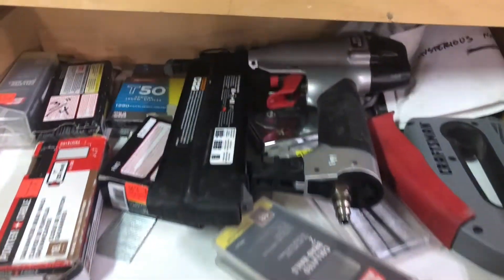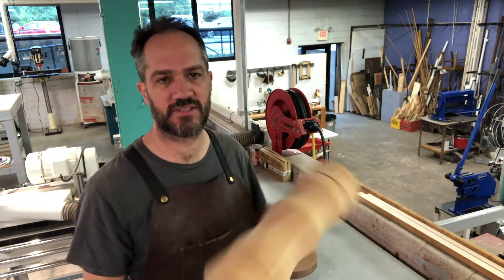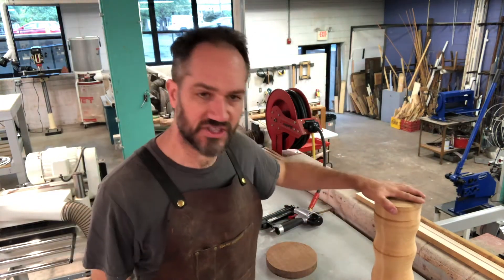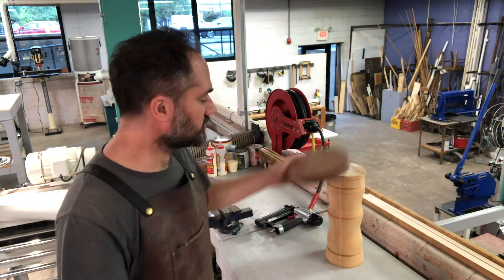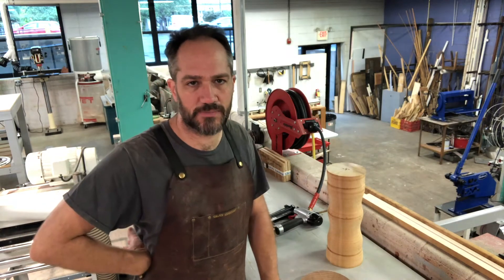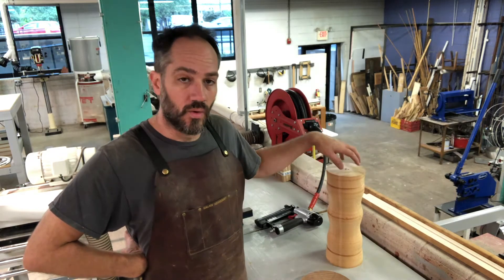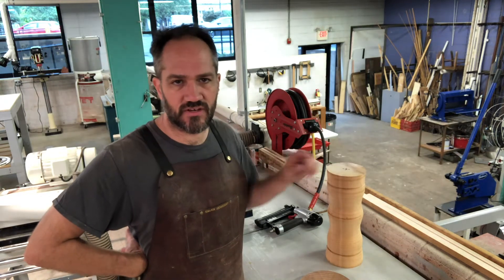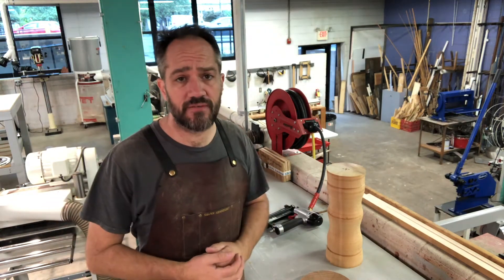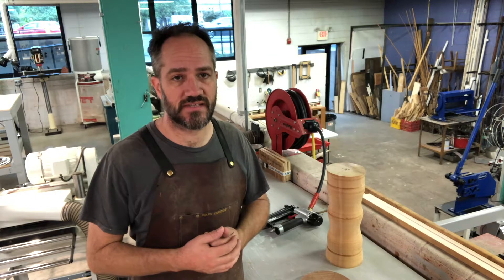In this video I'd like to show you the air nailer. It's a tool that everyone seems to need to use at some point or another. What I'm going to do today is finish off something I started in my demonstration of the lathe. I have this big fat spindle that I turned and I want to make a plant stand out of it. I've cut two circles of wood and I want to nail them to the top and bottom like a big chess piece. I'm going to use glue as the main connection, but while the glue is drying I don't want the pieces to shift, so I'll put a couple nails in. These air nails are very thin and small, easy to drive, and no one will see them once they're in.